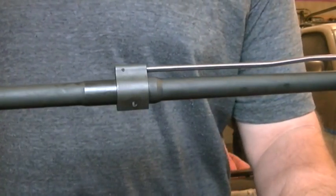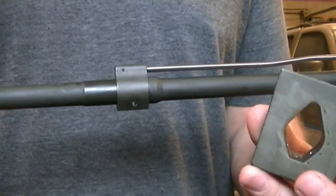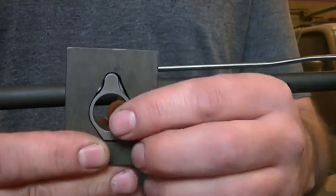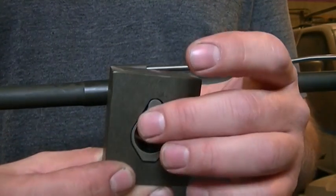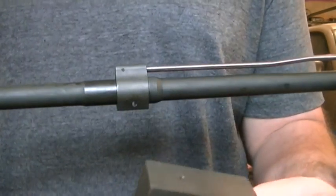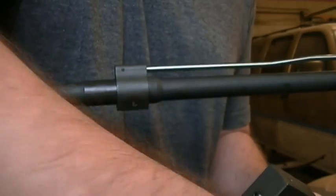So, on to the drilling jig. I've got two here. I've got one that has been modified and opened up to fit the Yankee Hill gas block, and I've got the standard one that you can buy, which is cut to fit the Voltor. If you buy one from any of those retailers, that's how they come — cut to match the Voltor. They're relatively snug. They're water jet cut, so front to back there's a little variation in them, but as soon as you tighten up that set screw, you're good to go.